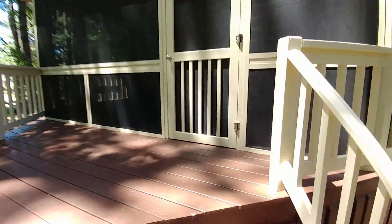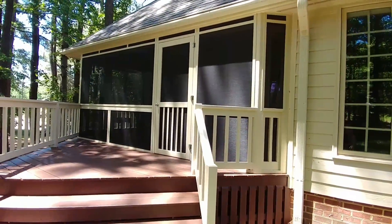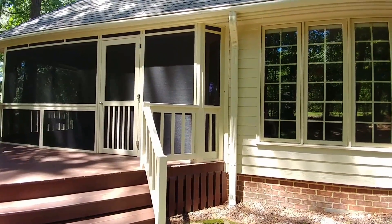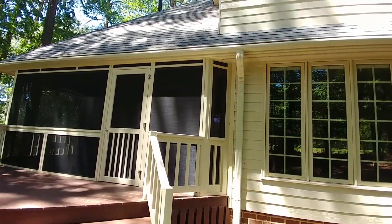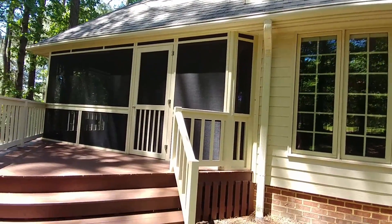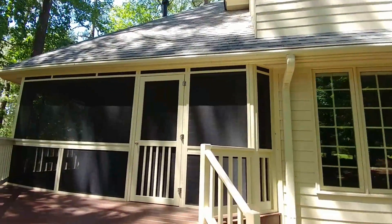Let's take another look at it from the outside. They got 45 degree angle cuts and 22.5 degree angles on the two corners. We brought it out flush on the soffit so that it gives them an extra foot. And also there's cove molding around the top.